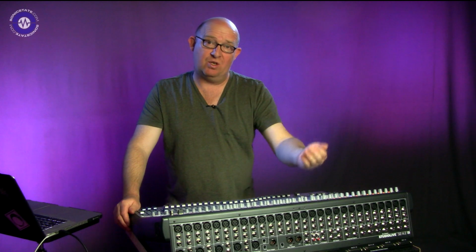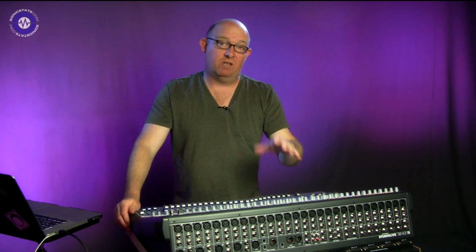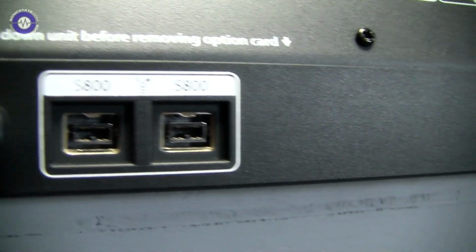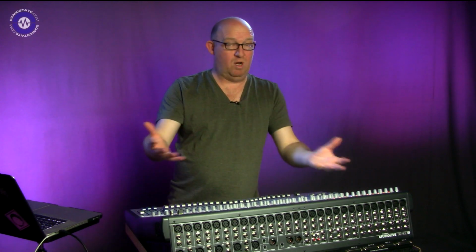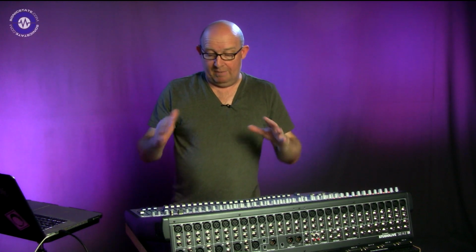So it's got 32 XMAX preamps, which are Presonus' high range, high resolution preamps. But it's also got a 48 in, 34 out Firewire interface card, so you can basically flip inputs and have multiple Firewire returns coming in. Having said that, it is very much geared towards live.